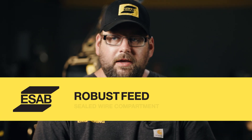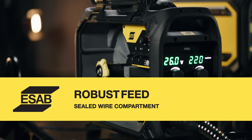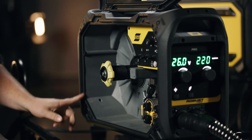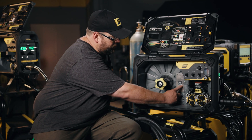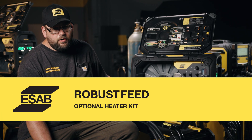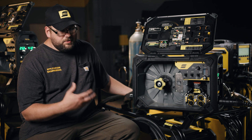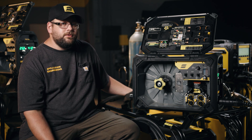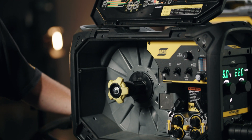With the door, the main key is the seal on the inside. When we unlatch it we can flip it up and see this gasket that comes all the way around the inside. There's a small kit inside here as well. The main purpose of this is to keep the inside of the case, while closed, from passing through the dew point. That temperature can change depending on relative humidity and other factors. It's not a heater to get to a specific temperature — it's just there to keep the inside of the case above the dew point so the wire does not end up with condensation on it.